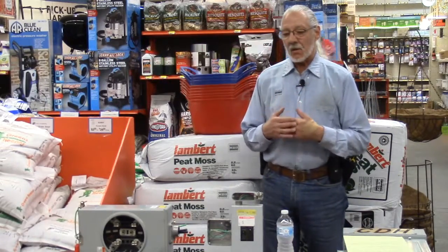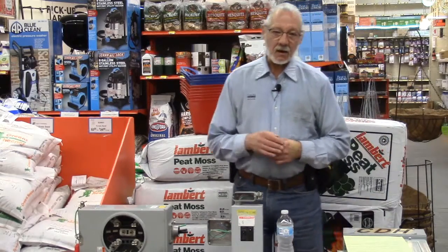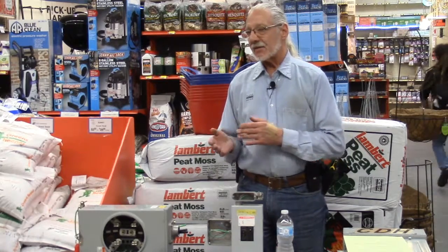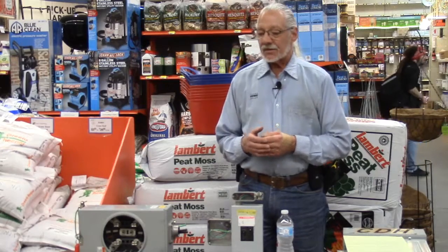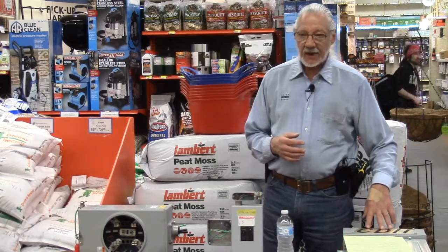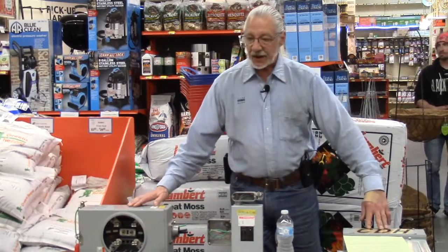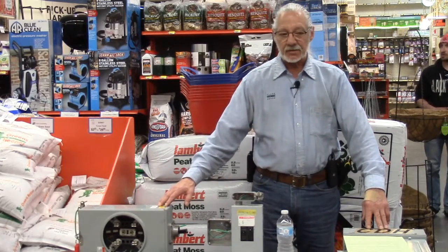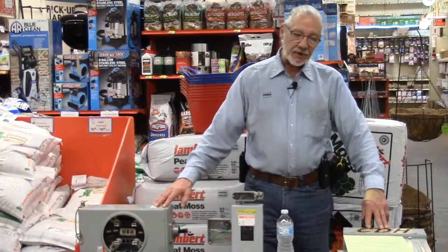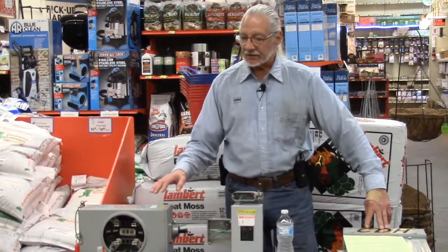So you're going to have to know what you want the new system to do. Are you planning to remodel? Are you just adding new appliances in? What do you want it to do? And you have to know what that amperage will draw compared to what you have now, and is your service capable of handling that new amperage? Again, if we get back to whether the service can handle it, you're back to permitting and ComEd and an electrician, at least to get the service in.